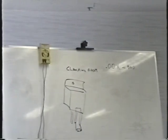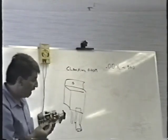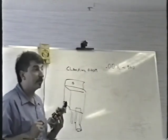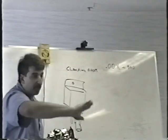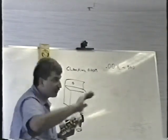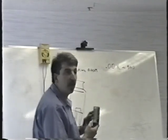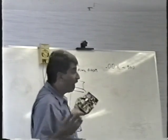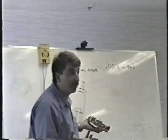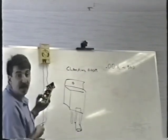Who's got that shorted diode? I do. All right. So I get to this power supply and I say, oh, is the fuse blown? No, it isn't. Okay, fuse is not blown. I'm not checking the transistors, the clamping diode, the bridge rectifier, or that 1.5 ohm resistor. I don't care anything about those. If those guys fail, other than the one ohm resistor, it would blow the fuse, right? So I'm going right for these diodes.